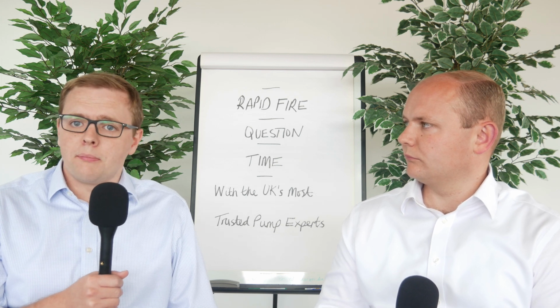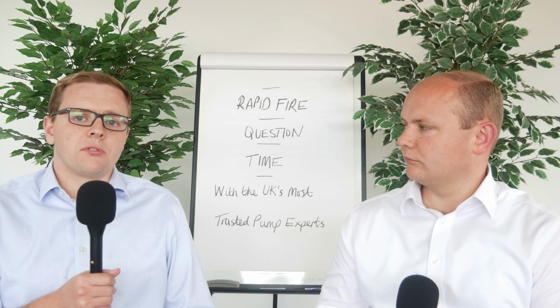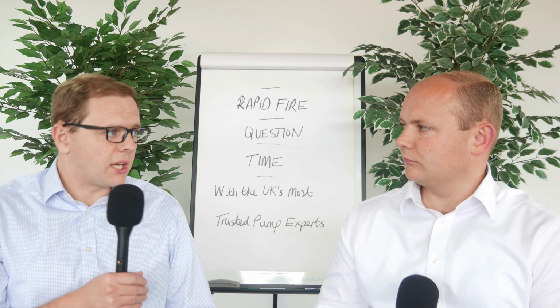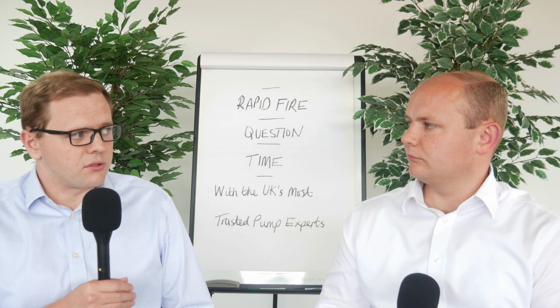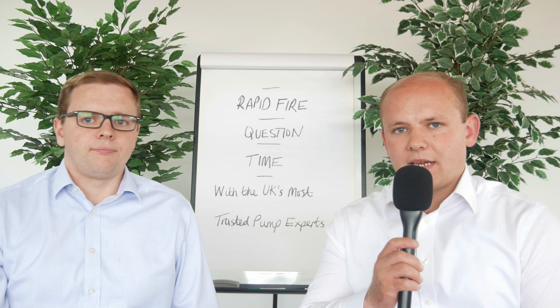And I know some manufacturers suggest that this is at least 5 times the overall diameter away. Sometimes it's more, but it's always best to check the manufacturer's recommendations for this when laying the rising main. Fantastic, and there's your answer.